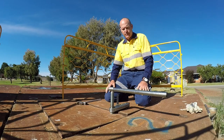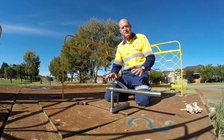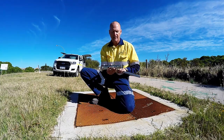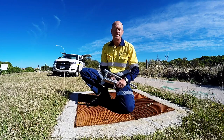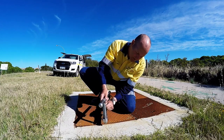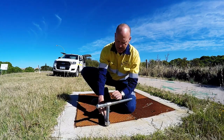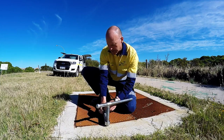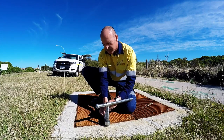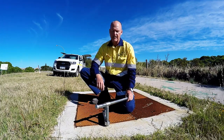Very handy device — Telstra, sewer, NBN or manhole covers for breaking those stubborn pit seal lids. Now I just wanted to show you, you don't need to pull the tool apart for each application. You can just leave it fully assembled. Right now I'm on one of the old Telstra steel lids. We can drop the T-bolt straight into the slot, drop it down, set it onto the job and just slowly do up the nut until it pulls in tight. You can tell by the tongue on top that it's locked in 90 degrees to the slot and the pit lid.